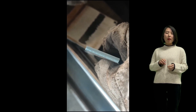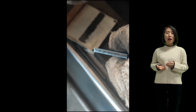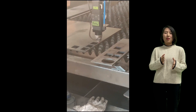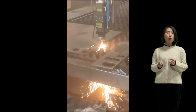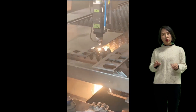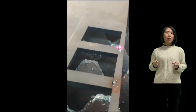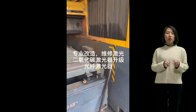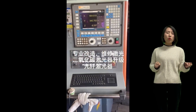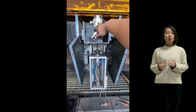The only problem is making the height adjustment — the amplifier of the capacitive sensor signal from the cutting head Z-axis. But if you are a service engineer, you will know how to do this transformer, or you can buy one from China. There are people selling these transformers. You simply install it and you can switch the G-code from the Bystronic or Trumpf control to the new laser and cutting head.